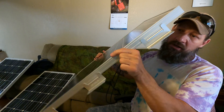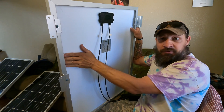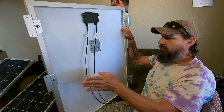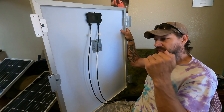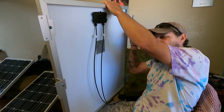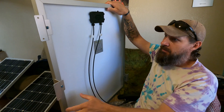The cool thing about these brackets is they raise up the bottom of the panel about one inch from the surface of the roof. So you have airflow potential underneath your panel. Depending on what type of panel you purchase, you might have three quarters of an inch or an inch and a quarter of space. This gives you room underneath your panels for airflow to keep things cool, lets water not collect underneath, and gives you just enough space to reach under and fish around the MC4 connectors to make your connections.